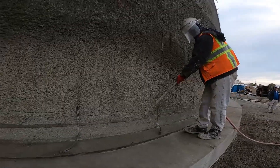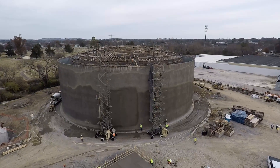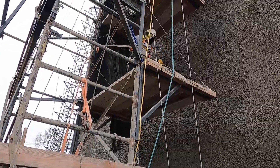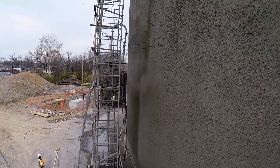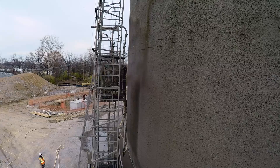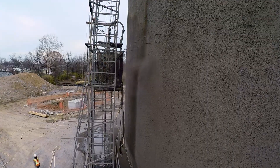We're building a 10 million gallon tank and in the past that was not possible just because of the amount of material that you would need to structurally hold that water. So now what we do is we take a diaphragm shell and then we take shotcrete, which is essentially high-velocity concrete — we inject air and water at the hose and shoot it to make very high-density concrete.